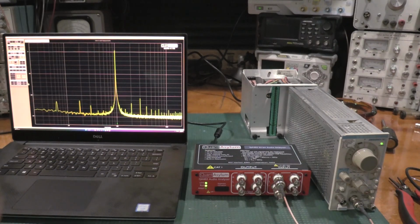Okay, that's better. 0.00038 and 0.00052 is the total harmonic distortion plus N. We got about halfway to go. And this is in the floating setting, so if I ground it, it should get even better. So this is about worst case scenario.